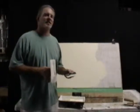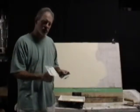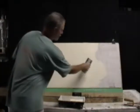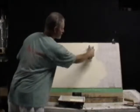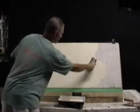As an alternative to the last texture we demonstrated, we're going to do the background for stone blocking. Using a stainless steel trowel, I'm pulling a tight coat of the tinted quarry stone on. This will serve as our background, over which we will then tape and create our stone block pattern.